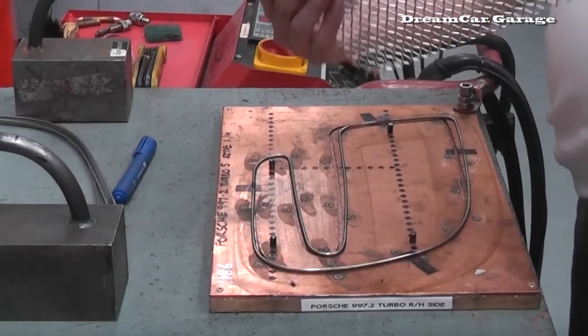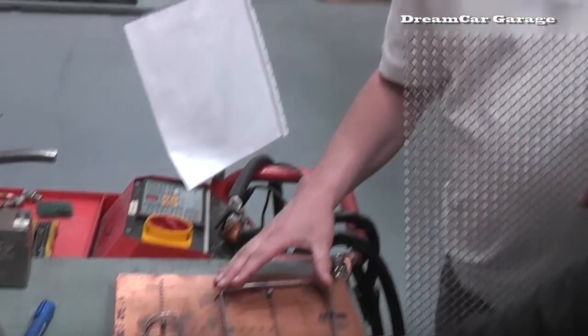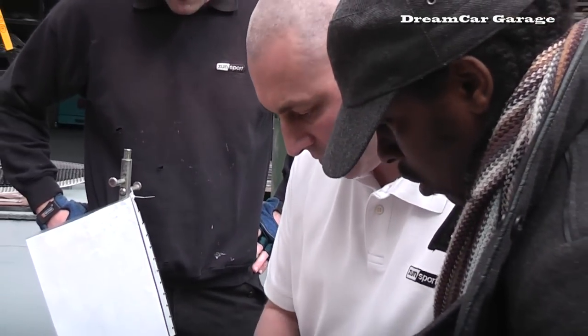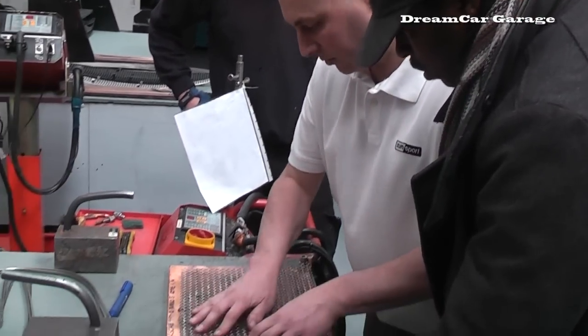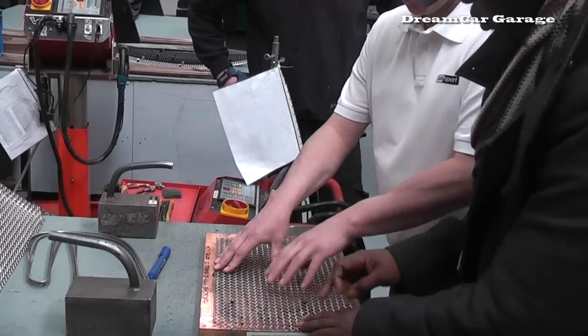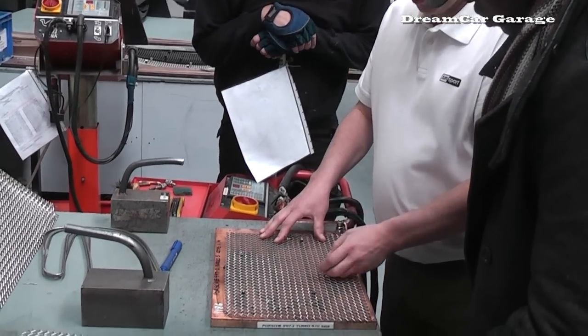Then we spot weld the mesh to the frame. So you put this over, and this goes over now to cover. Make sure your diamonds are all in line with the diamonds on the jig. Oh, I see. And then we're ready. That makes sure it's all horizontal, nothing's diagonal. Every grille is uniform then. Right. Okay.